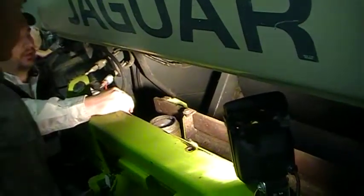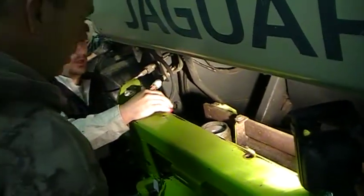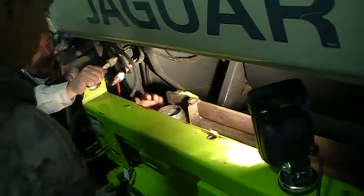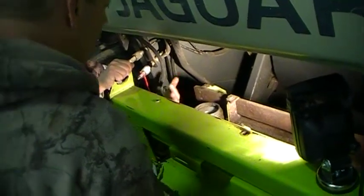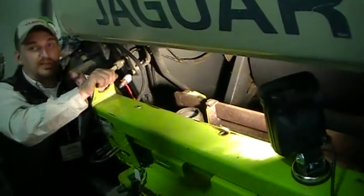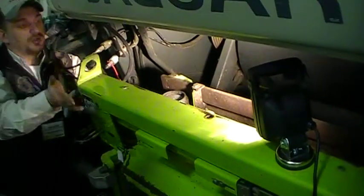One thing you've got to do first, though, is open the sharpening door. On some of the models it doesn't open, but even if it's not open, you can push it open. Then you can physically push the whole holder over the cutting cylinder, because this is going to be all the way back over here. Some push easier than others. You need a little force to get that over. So you're going to push the door open.